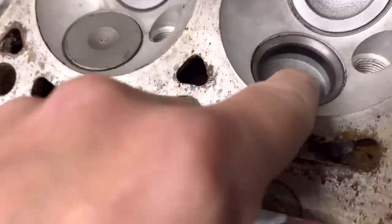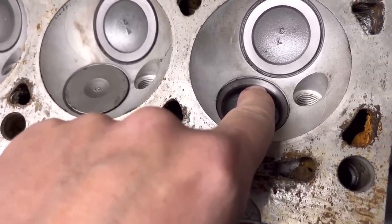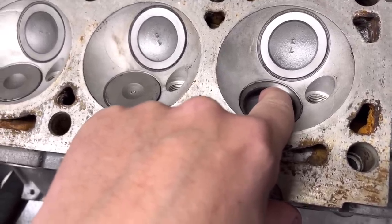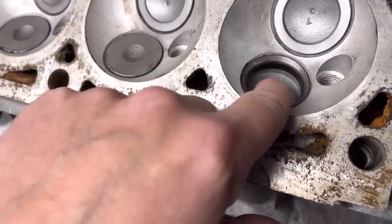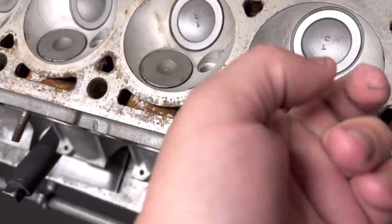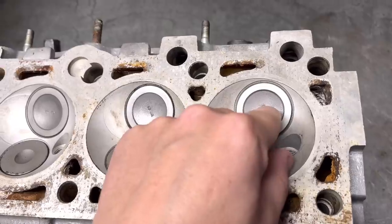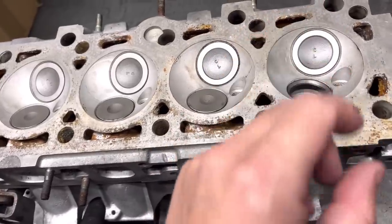What I'm going to do this morning is set this up. As you can see, you've got a three-face cut but you've got about two and a half mil of 45-degree seat on there, which is way too much. What we're going to do is set the one and a half mil three-face cutter right to the outside edge of the valve. The inside of the cutter cuts down into the throat, and it's probably going to leave about a mil and a half to come out of that throat, because if you feel under there there's a big sort of ridge that doesn't really need to be there. We're going to take that out, then do the same on the inlets. On these you can normally take about two mil out of the throat of these inserts and that's going to give them a bit more torque.